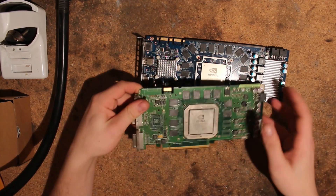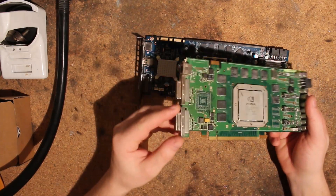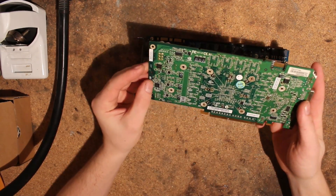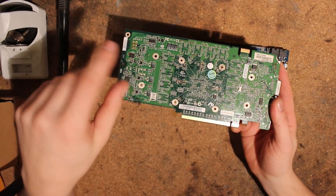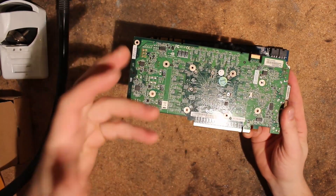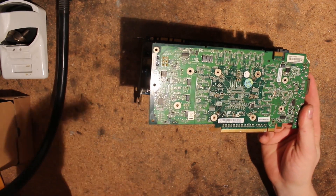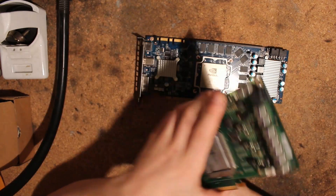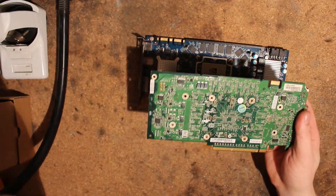Now there are some cards that also have this sensor but it doesn't seem to matter as much. This is just a parts 8800 GTS — you can tell it's dead from the missing corner chip. There's also a sensor chip here, but the G80 doesn't have 2D clocks, so this thing is not going to thermal throttle on you. It might turn off the VRM though — I'm not sure. I've actually never run an 8800 G80 card on LN2 without using e-power first, so I have no idea if the stock VRM shuts off.